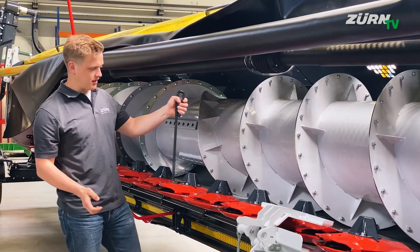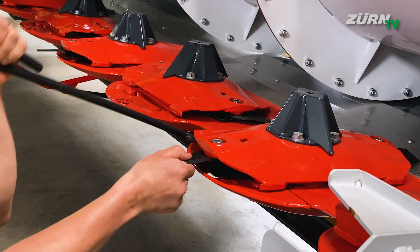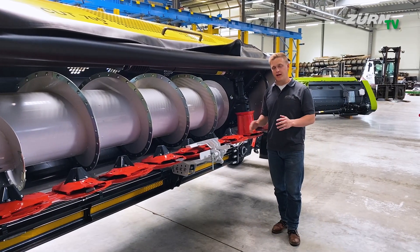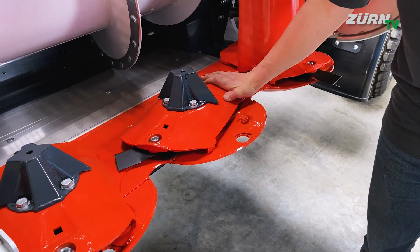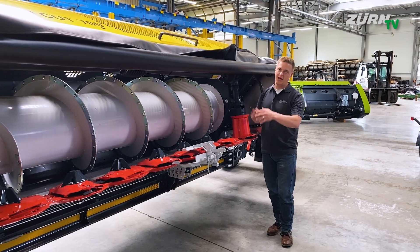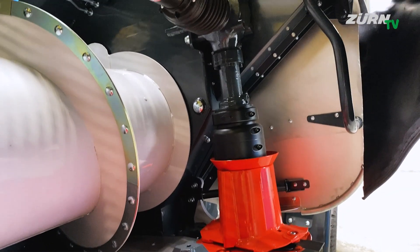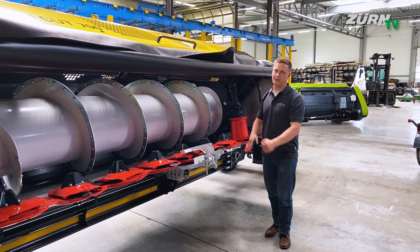There is also a knife quick change system. There is a lever which you can simply push in behind the knife and pull it down to release the blade. The Kuhn mower bar is lubricated for a lifetime and has very little play between the individual discs, so we can synchronize the two bars perfectly, with the drives outside where they don't disturb the crop flow without any risk of collisions in the center.